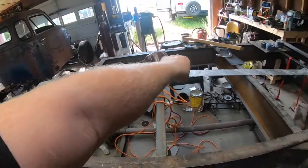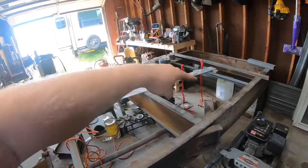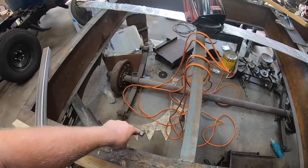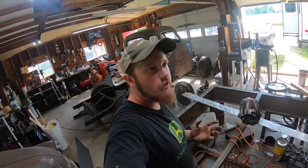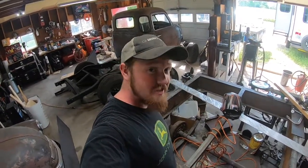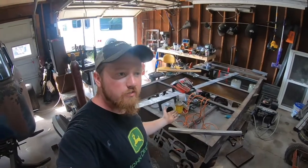with it in all of these pockets, I'll call them, and then maybe one going through it, so that there's only this much room for it to warp. And then with 3/8 is what I'm looking for. I don't want to go 1/4, but at least 3/8. And then I want to get a mag drill and drill just a bunch of holes and make my own clamps, because as most of you know, our 2020 projection is to have a working shop, and every working shop needs a good fab table.